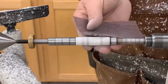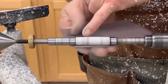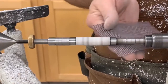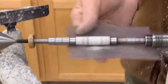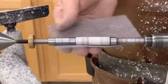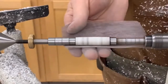One of the things you'll notice, and it depends on the bushings that you have for your project — your blank will start to get dirty. That's nothing to worry about. That is actually coming from the bushings. A lot of the bushings come in with a coating, a dark coating on them. And that'll come off with your micromesh. All right, two more grits with this one, folks. We're going to hit 400 now. Doesn't take very long. Now we're going to hit 600, and then we're going to get into our micromesh.